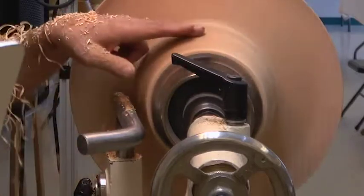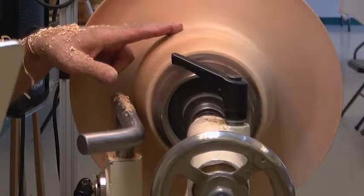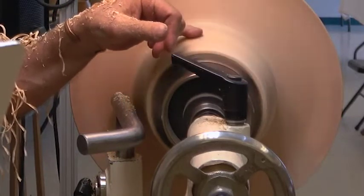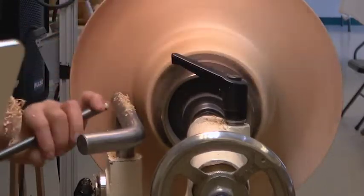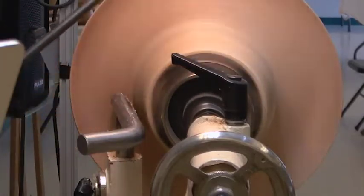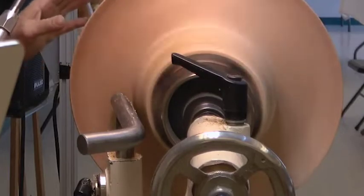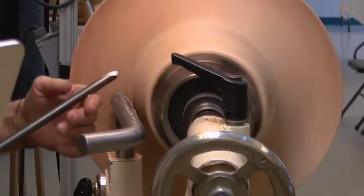Well, I got a little bit of a hump right here. I didn't come up with a relief for the edge of band that I wanted. So I need to pick up a cut back here, get rid of the hump, and dive a little deeper here, leave the edge of band. Picking up a tiny little cut from nothing and sliding into it without some faceting happening is hard. It's one of the hardest things you can do.